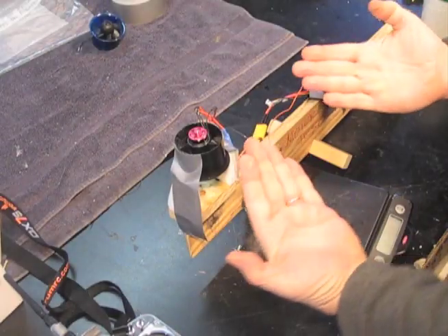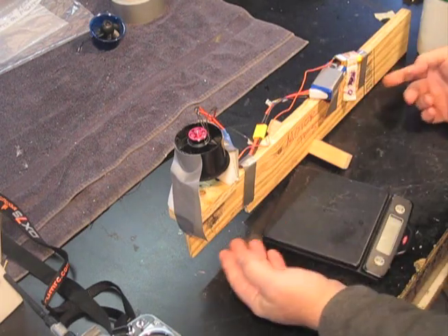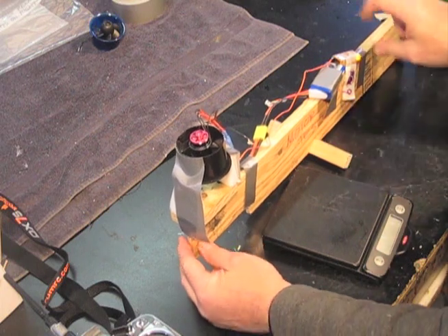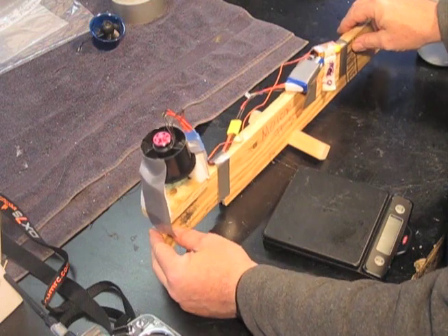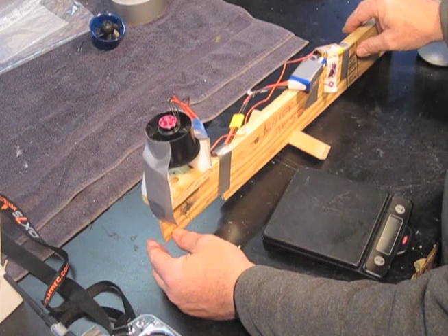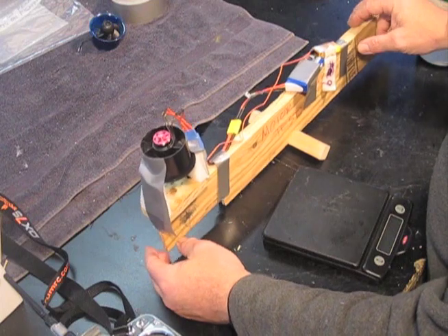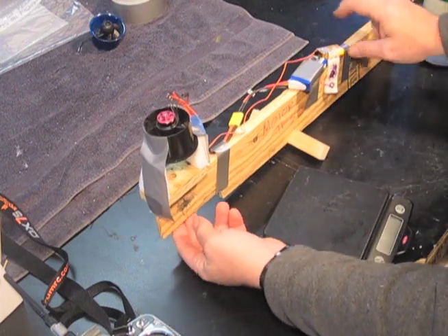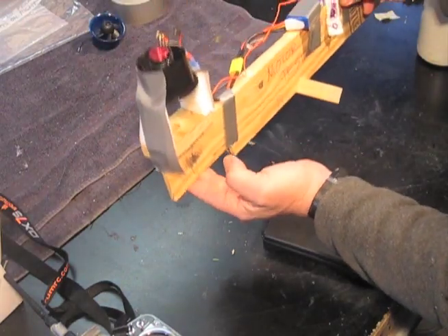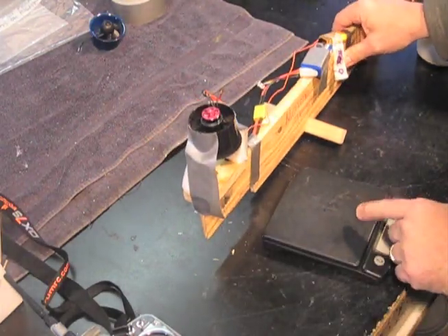Steve's Hands from Killer Planes here today with a thrust tester. This is a simple balance beam, like a seesaw. We put it on a piece of wood that's angled so that the balance part is on a point rather than on a flat or round piece — that makes it very precise. It's going to go one way or the other from that point. There's a little screw that protrudes further than the rest of the cut, so it'll be the thing that hits the scale.